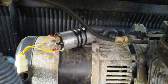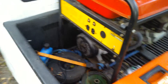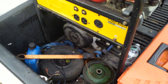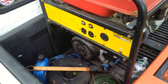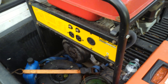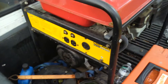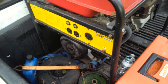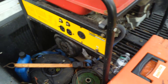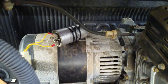I put a capacitor from an air conditioner in there — voltage rating doesn't matter. The generator came with a 35 microfarad capacitor from the factory, so I put a 35 back in it and it ran everything: fan, lights, everything. But I have a little air compressor that pulls 10 amps at startup and it just wouldn't push it. So I put a 50 microfarad capacitor on there.